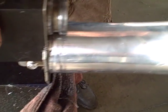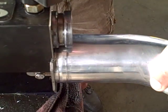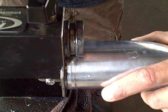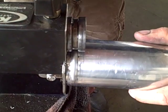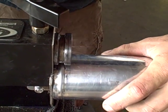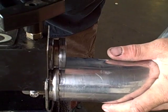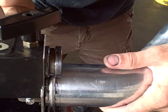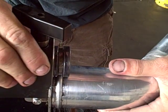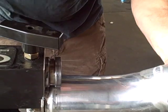It takes a little bit of work, but a lot of times you can get a good bead going. This cut is not exactly perfectly straight, so I'm having to do a little bit more work than I'm used to. We're trying to run a bead in this whole pipe so that when boost is applied behind this clamp, it doesn't blow the pipe off. There's nothing worse than trying to drive your car hard and having a turbo pipe pop off, leaving you stuck on the side of the road with no boost. Got an aggressive bead going.